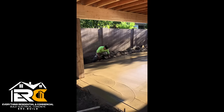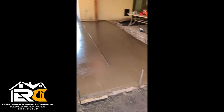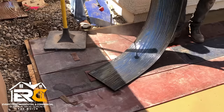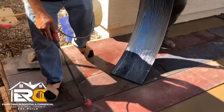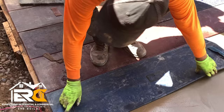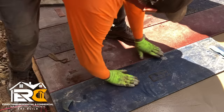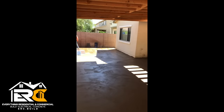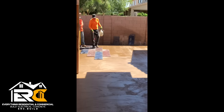Now pause for a second — this concrete is sloped tremendously. We'll probably have a five-to-six inch drop in an 18-to-20 foot span. Let's show you how to do some stamped concrete. After we get the boards and steel on there, we get a release agent — the concrete's pretty firm at this point; you drop a penny, put your fingers in, it's firm and they're walking on it. You put the release agent on the silicone mat and the concrete. Then he gets his hands and taps it, gets it snug in place. You get a tamper — it's a big stick with a pad on it, you can see it on the left — stamp it down and pull it off. And shazam, you've got yourself stamped concrete. That right there is going to be like an eight-inch barn wood look.